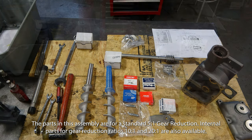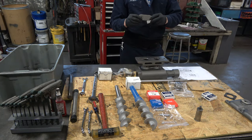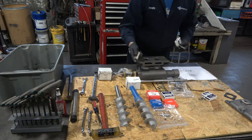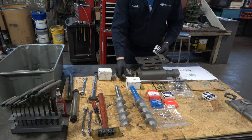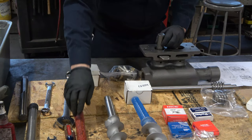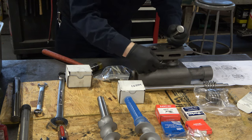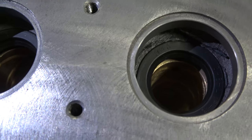As I install the seal, part number 35144 — there are two of them — it's very important to insert them through the space and then we use a special tool to make sure that it's driven all the way in. It's important to make sure that it's centered, and you use the plastic mallet and drive the seal all the way in.